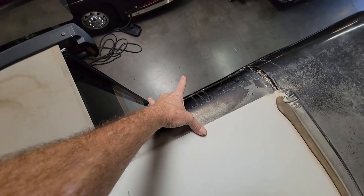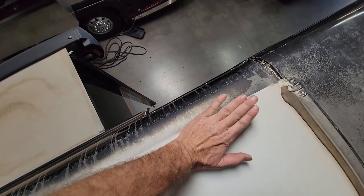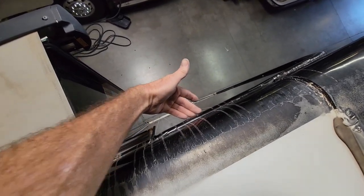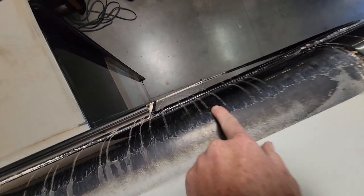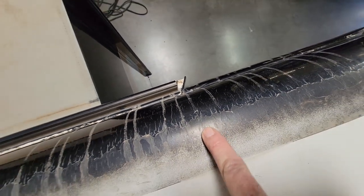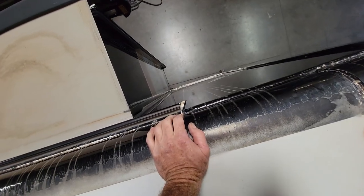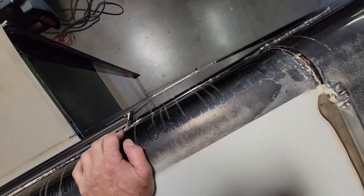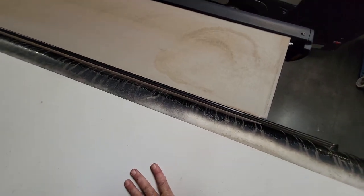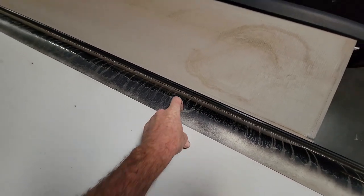This radius is again part of the fiberglass roof — it comes off in the mold and then they bend it over and secure it down with the molding. We do have what I would call checking, which is not going to be uncommon in these fiberglass sidewalls and roofs. You can also see all the paint damage occurring on the roof, which is why I'm going to recommend you wash and wax your roof too — that will help prolong the life of the fiberglass and the paint.